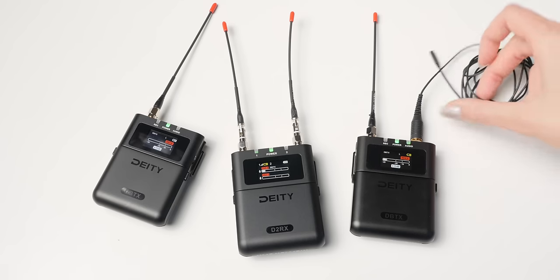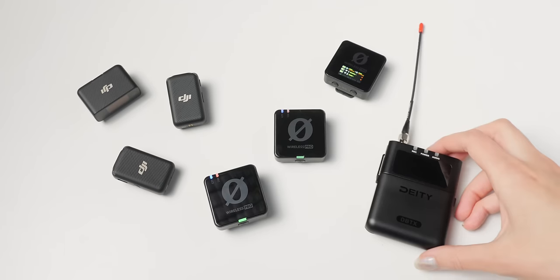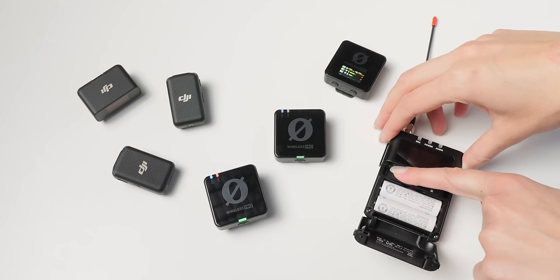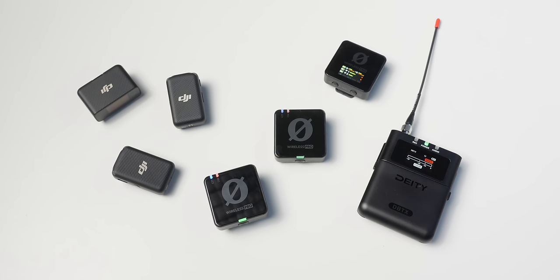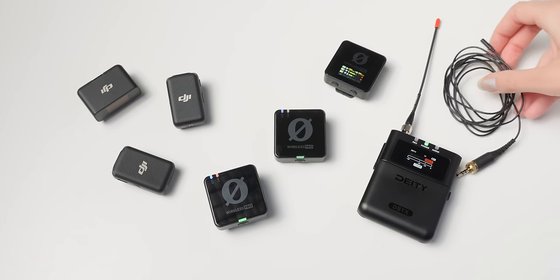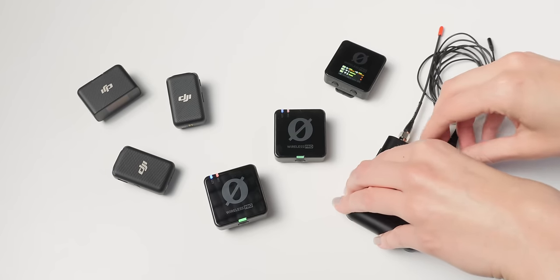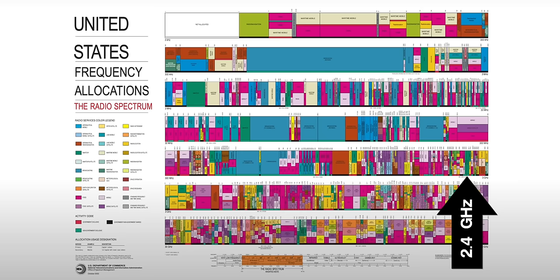The kit I got has two transmitters with a single dual-channel receiver. One receiver can receive audio from two separate transmitters, each with their own microphone. It is a digital wireless microphone system that transmits in the UHF bandwidth. That makes it very different from a lot of consumer-oriented systems out there, like the Rode Wireless Go, Wireless Pro, DJI Mic, Hollyland Lark, and others — which all operate in the same frequency as Wi-Fi: 2.4 gigahertz.